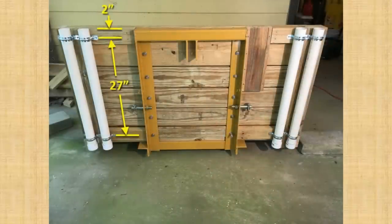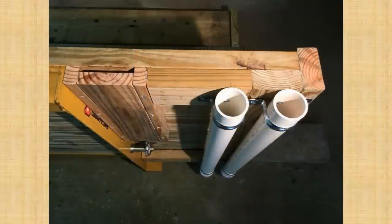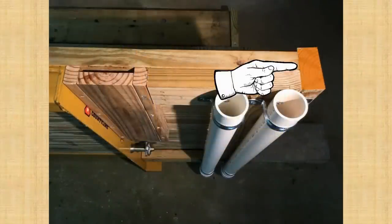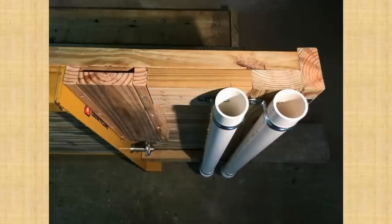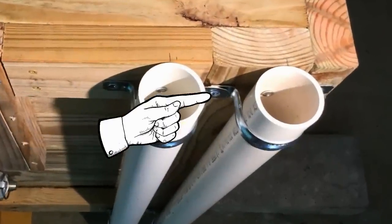The pipes are attached to the carry-all with 2-inch metal pipe brackets top and bottom, spaced as shown. The top of the pipes are flush with the top of the carry-all back. Note the 2x4 blocking added to provide a level area to attach the pipes — the blocking is attached with 2.5-inch deck screws. From this view, you can see why I wanted those edge 2x4s flush with the back of the backboard: they give a total of 3 more inches of width to attach things on the back. Notice that the brackets of the outermost PVC tube attach to the edge 2x4s, and the pipe brackets overlap to save space.